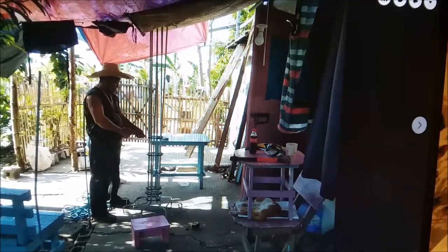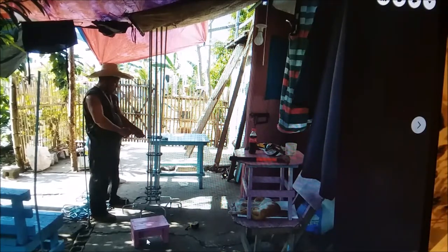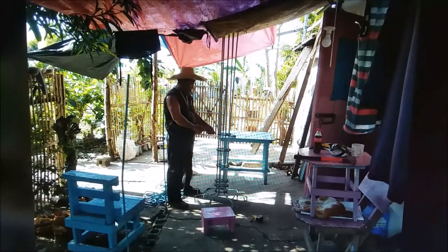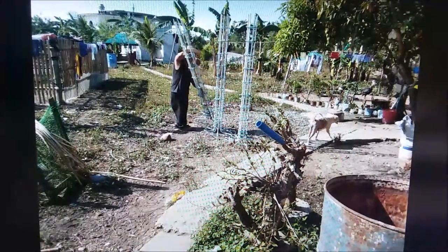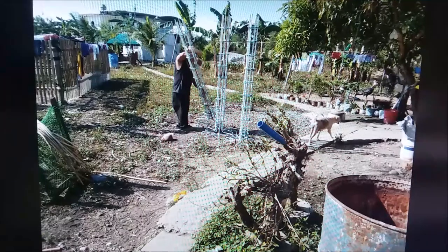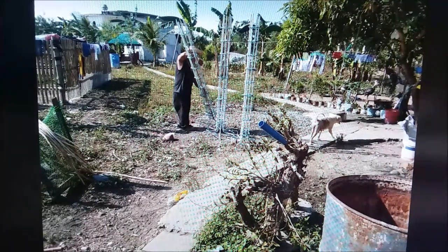He's found a nice shady spot behind the house and he's putting these things together — there are 21 of them. They make furniture out of every leftover piece of lumber; this chair probably weighs about 30 kilos. He's got a particular height marked for where all the rings go — probably marked off with a Sharpie. You don't space stirrups more than the narrow dimension of whatever column or beam you're doing; that's the outside limit.